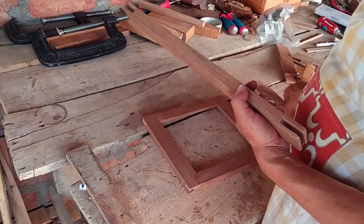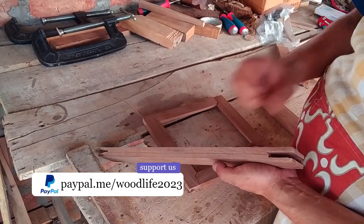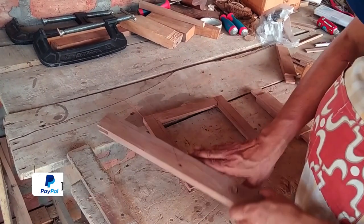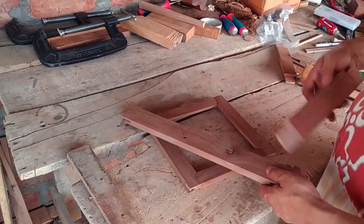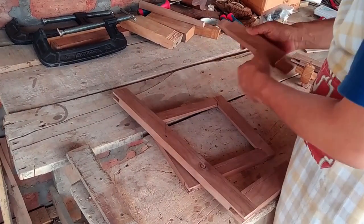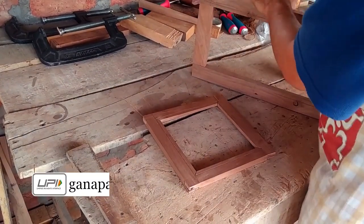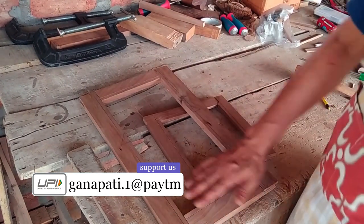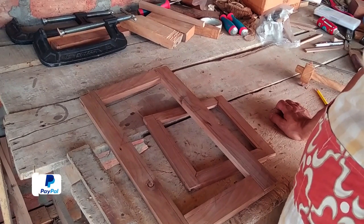I also made the bridle joint for the next door. This should have a groove to house the wooden panel, but I decided to create a rebate because I do not have the same material for the panel. Therefore, I will be using a pine board. If the pine board does not look good, I should be able to change it later.